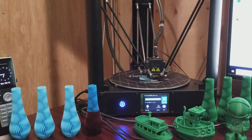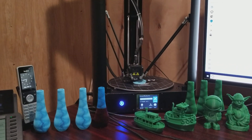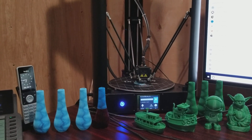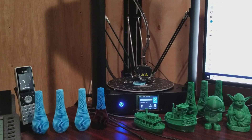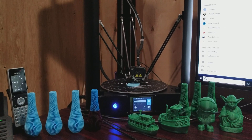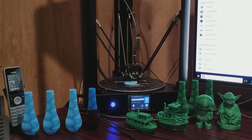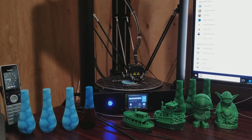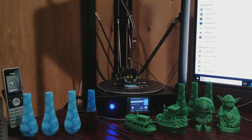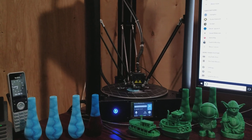The unit does come with Wi-Fi. It comes with a Wi-Fi dongle attached to the back of the TFT. I did a little research on the Wi-Fi, and there are two concerns. One is the app they want you to download is from an untrusted store — you can't get it from the Apple Store or the Google Store, you have to side-load it, which is not safe. The second thing is in the config on the wireless, I saw it phoning home to a server in China for something called Cloud. So I'm not using the Wi-Fi feature of this printer, which is why I tried hooking up OctoPrint to it in the first place.